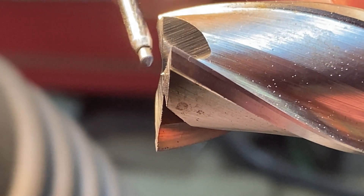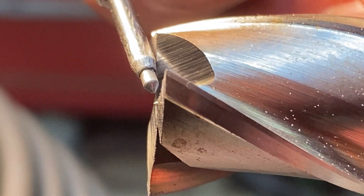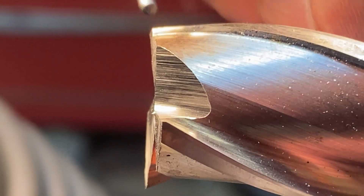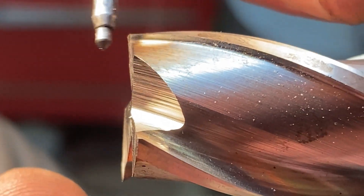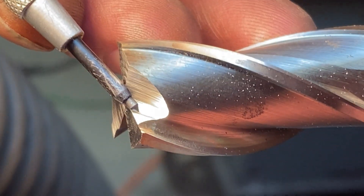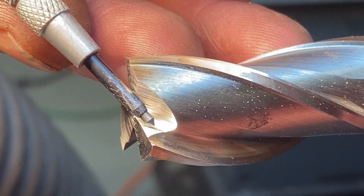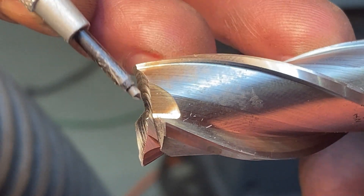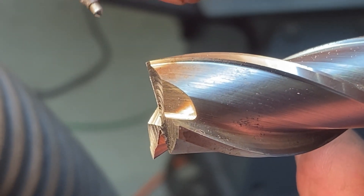If you look now we've pretty much split that little point right in half, which means we are to center — that's super important if you want this thing to drill. I've just nicked this corner as a witness, which is fine, as we put the relief angles on that'll go away. You can see a witness of the original gash, and the reason is the original gash had a very slight rake to it whereas this gash is at 90 degrees. Now we can go ahead and gash the other two areas out, being careful not to interfere with that center cutting point.